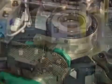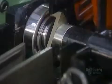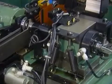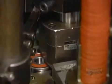Now it goes into a solvent bath, then through a series of automated quality control tests. This noise vibration tester makes sure the ball bearing operates quietly. Some types of bearings are lubricated with grease. A machine squirts grease evenly into the bearing's raceways, then inserts a rubber seal to contain the grease.